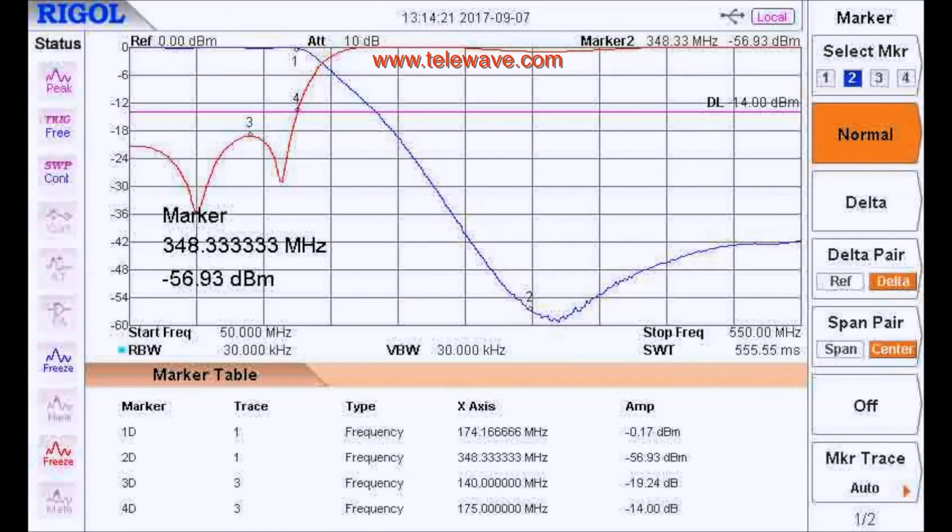We'll get into more of this in another video to show what some of the curves look like and discuss some of the uses. But essentially, it rejects any frequencies — spurious or otherwise — that are probably already 80 to 90 dB down from design on the transmitter, but still might land right on top of a frequency you want to use in the 400 MHz band. Therefore you might want more attenuation, and 40 dB more would help quite a bit in that regard.